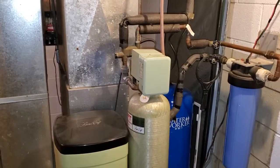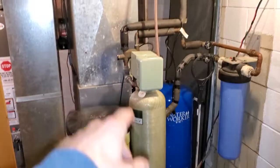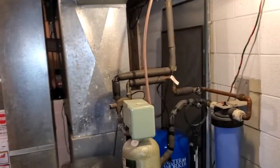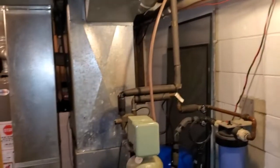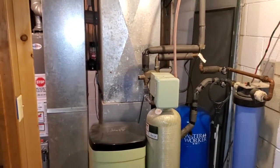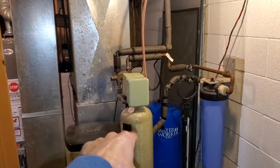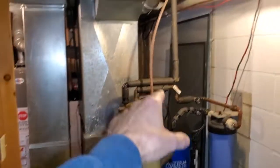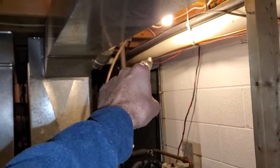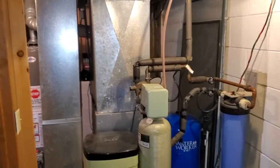This is something I see probably 90 percent of the time with water softener drains — where they're tied into the sewer system directly, which is called a cross connection. That's not allowed in the plumbing trade. It's where you're connecting the drinking water system, since the water softener is hooked up to drinking water, and tying that into the wastewater drain — which you should never do unless it has an air gap.